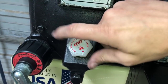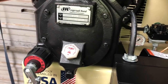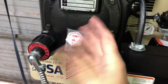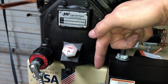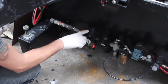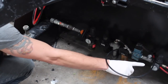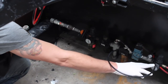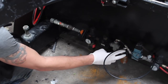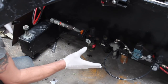The cool thing about this particular compressor is it does have a low oil shutoff switch, and I believe the oil is good for about 2,000 hours — how you gauge that I don't know, so if you know, leave a comment. One of the next things I'm going to do is replace the main air filter and the secondary filter — I'm going to get rid of the old setup. I'm also going to replace the main regulator. The secondary air filter I'll put over here, and the main filter will be on this side — that's how our workforce does it.